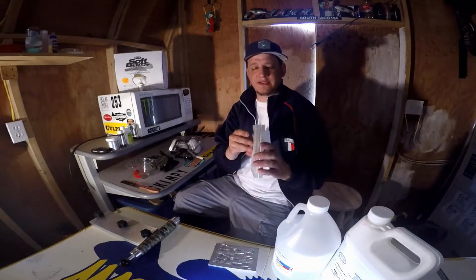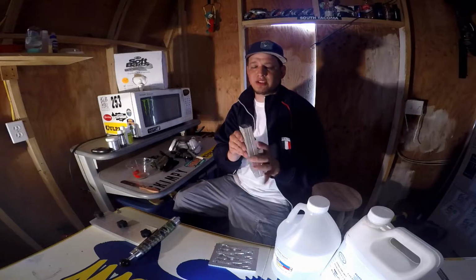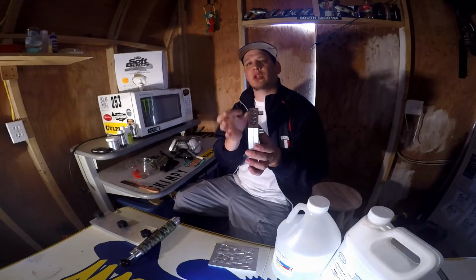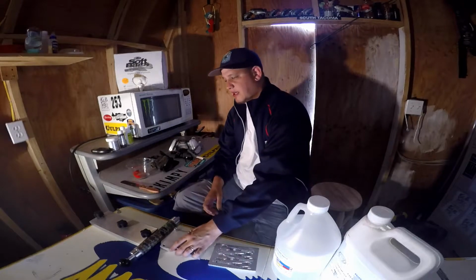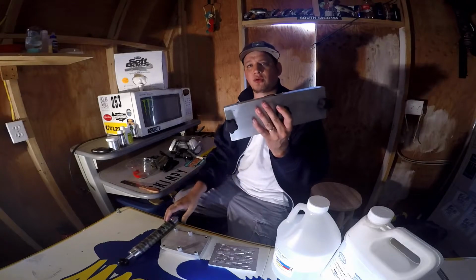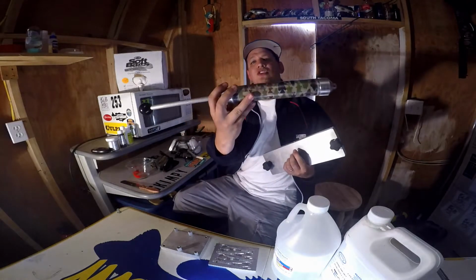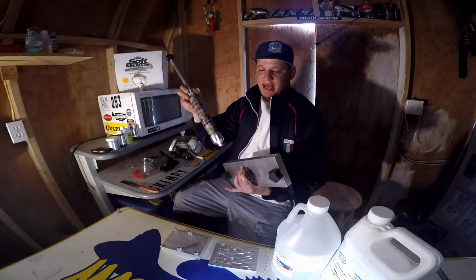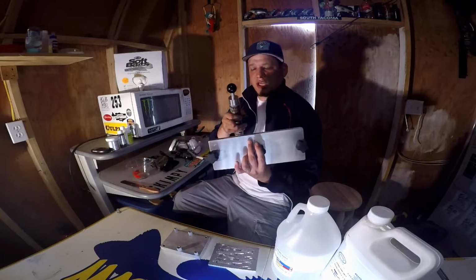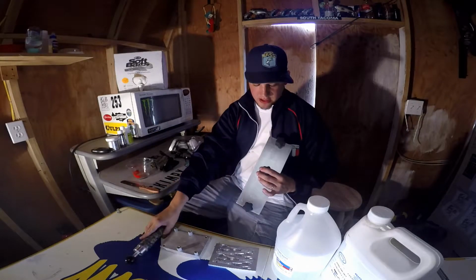Another type is a two-piece hand pour mold. Once again, you pour it right into the cavity, but this time it makes a fully round bait. The other style aluminum mold is an injection mold. To use an injection mold, you need a hand injector. So you would suck up the plastic and inject it right in. And you can get a lot more details using the injection mold.